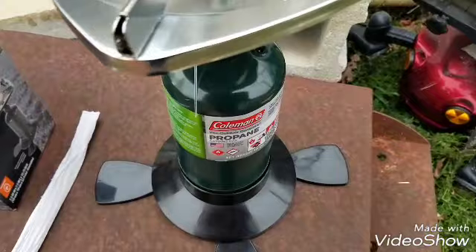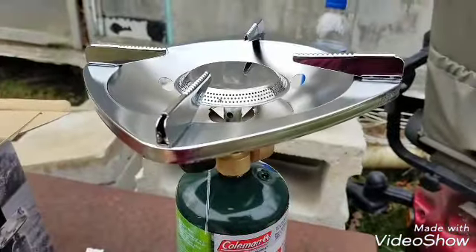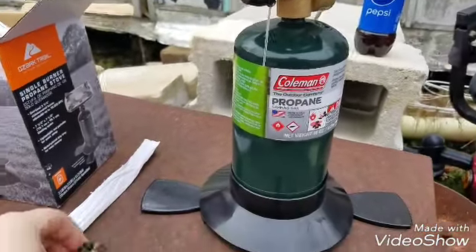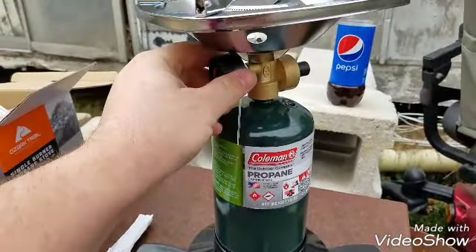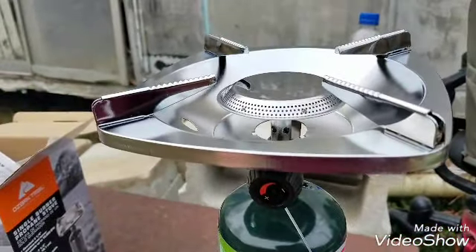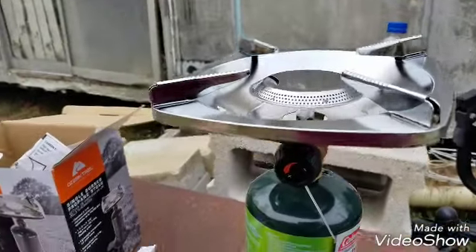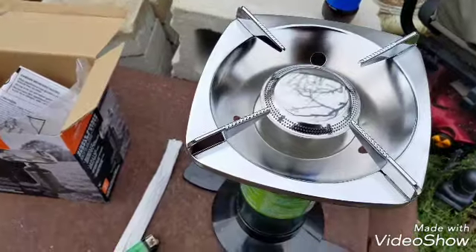What I'm doing now is heating it up and letting it anneal — or whatever you want to call it. I'll light this paper towel on fire, then gently crack the valve open about an eighth of a turn, let it sit for about a second, and then touch the flame over to it. That way it keeps our hands away from the initial whoosh of fire.